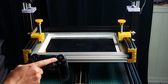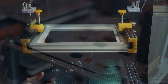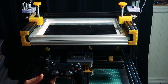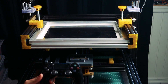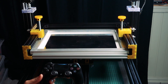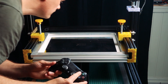The machine is controlled by a PlayStation controller and driven by Trinamic stepper drivers which I can control directly through USB. That also gives me the possibility to program the entire machine in a high level language like Python 3 and use all the libraries for Python 3 like the gamepad support in Pygame. I actually wrote the entire software in about one hour, which was really cool.